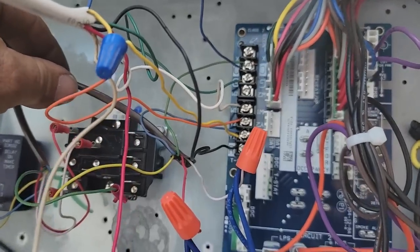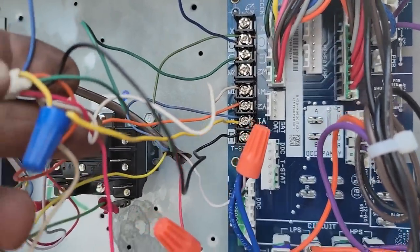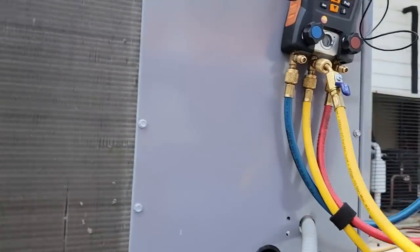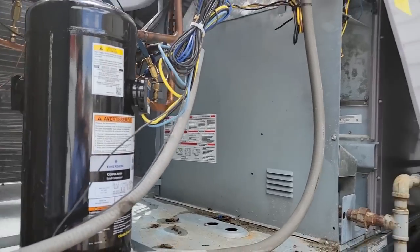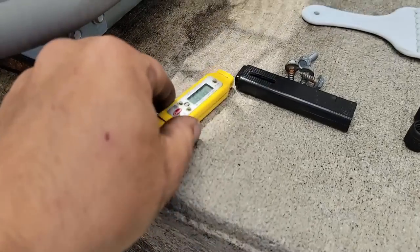Okay, this is a bumbling mess. You've got Y1 and Y2 going straight to it from here. So here's where we're at — we brushed that off because I haven't found the water spigot yet. Anyhow, head pressures have come down. I want to show you something we've got going on. Look at our evaporator — it's running 25 degrees and 102 on our condensing. We're right at about 15 degrees over.